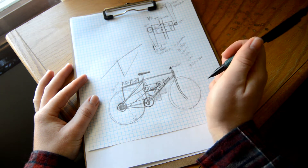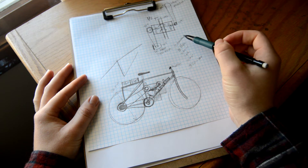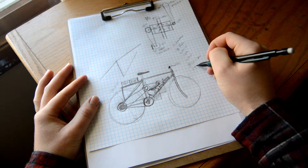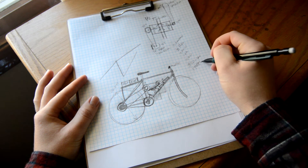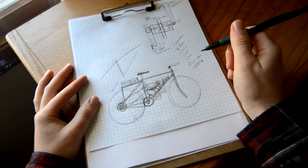And overall, with the math that I did earlier in the calculator, from 2,500 RPM, by the time it's at the wheel, we should have a speed of around 17 miles per hour, which should be just about right for the 250 watt motor.